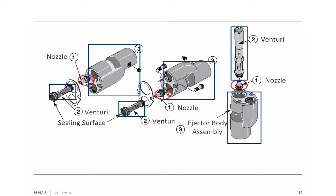And of course, it's got a pump body. Here's your jet body right here. This particular jet body is called a double pipe jet. You'll notice the two on the left-hand side are horizontal and the one on the right-hand side is vertical. The one on the far left has what we call the suction hole on top and the drive hole on the bottom. That's industry standard, and our SL and HL pumps are designed with that particular connection.